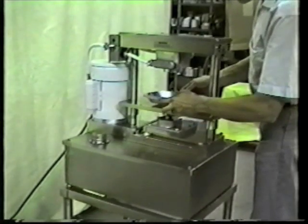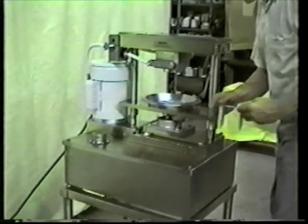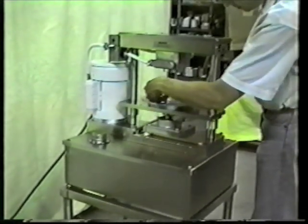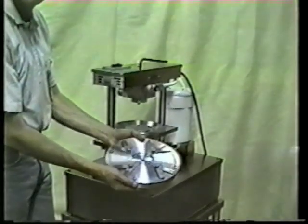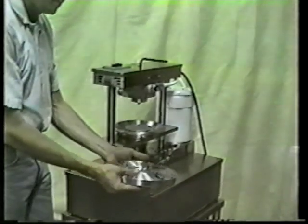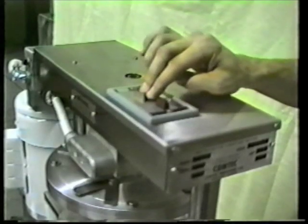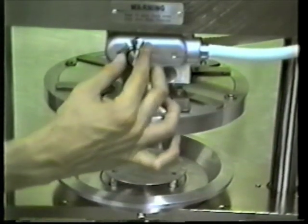The 1100 will now be prepared for bottom crust production. First, the nest and pan lifter are installed and secured in place with the die-retaining thumb screw. Next, the punch is attached to the 1100 with the provided Allen wrench. The 1100 is then switched on, and the thermostat is set.